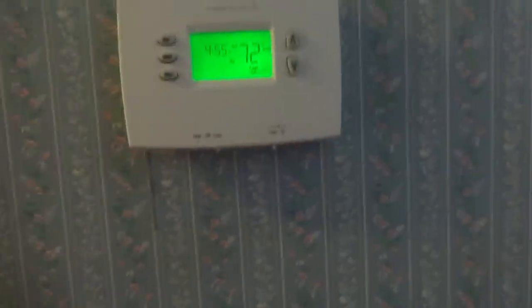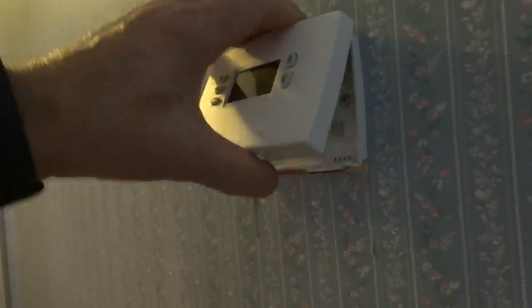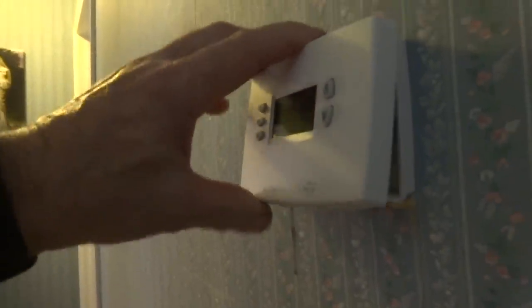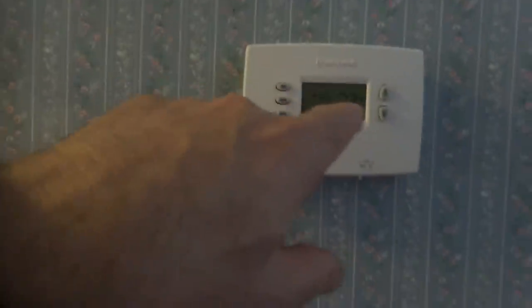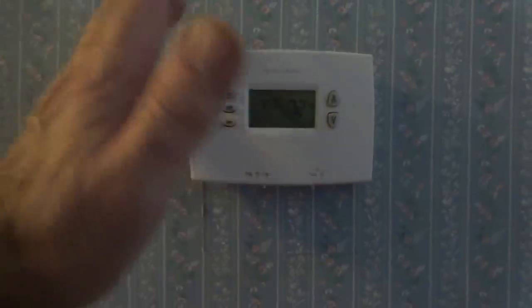So what do you want to set it at - 70? 72. All right. So if you have to change the batteries, you want to grab it from the bottom like this and just pick it up. It hooks in the top there because there's pins there - see them pins in the back of the thermostat? Those have to go inside these slots. When you put it in, you have to hook it on the top like that, then push it in. Don't jam it - if it's not set right you're going to bend them pins and then you're screwed. Those little pins are very wimpy. So do it like every year - when this no longer reads, you know it's time for batteries.